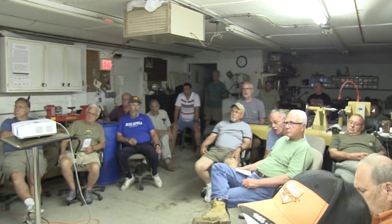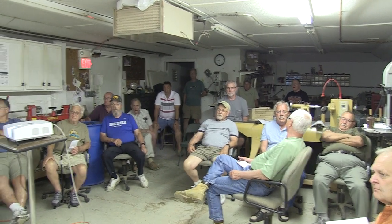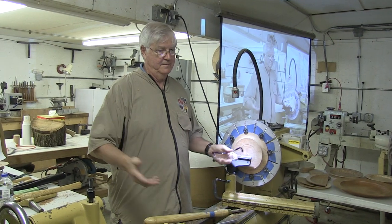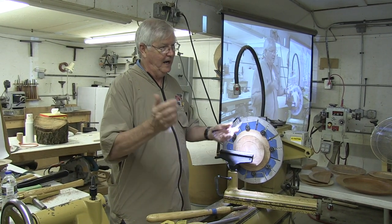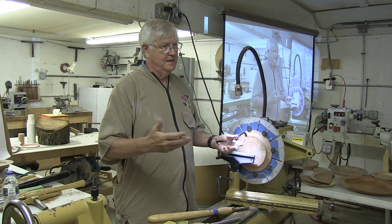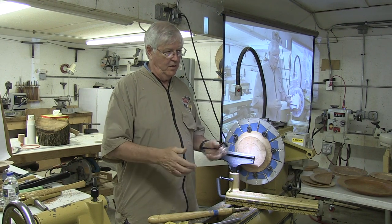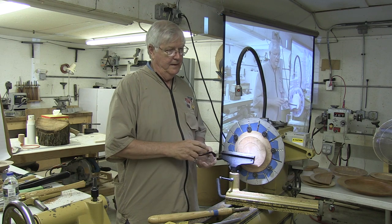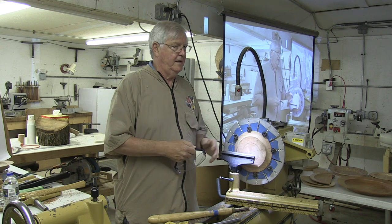How many coats do you put on? As many as it wants. You know, if you watch Mahoney do it, he has a barrel that he soaks it in or something. But I don't do that. I apply it. I let it eat what it wants, and if it wants a little more, I give it a little more, especially in the end grain. And then I let it dry for a couple of days and test it again. If it's thirsty, I give it another dose.